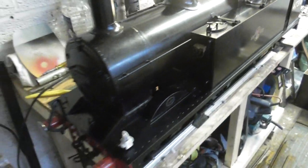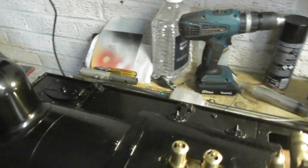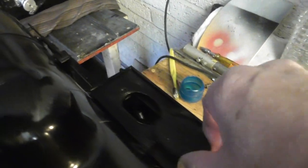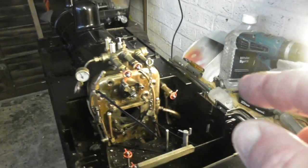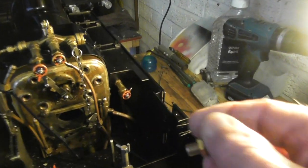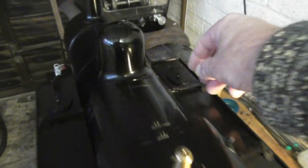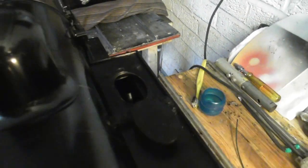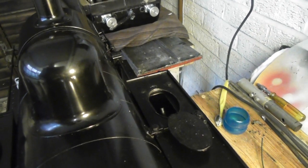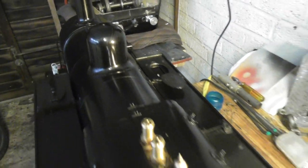It's a lovely engine — everybody admires it, the detail and everything. There are a few little things I want to alter, nothing major. I use the hand pump — not the axle pump — and I think I'm putting a lot of stress on the clack valve itself. That's the one I had trouble with — it was blowing back. I had steam coming up into there, which means the ball hasn't sealed. The pressure of the loco hasn't sealed the clack valve, so it's letting steam go back in — and water — and of course that drains the boiler, which is very dangerous.